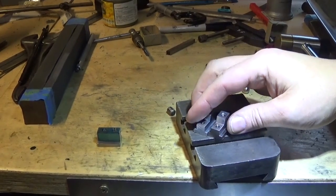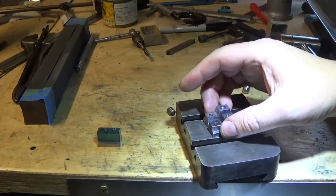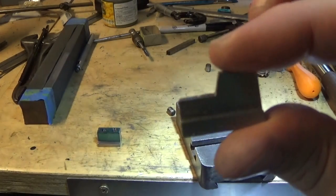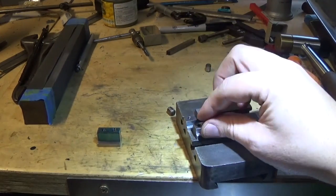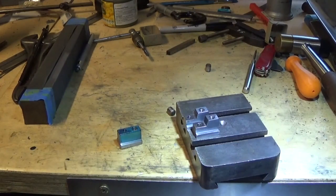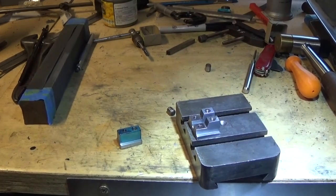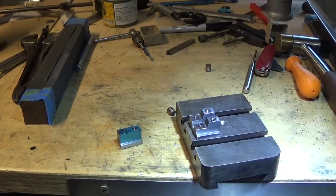But there are a few questions that have been asked about this, and a few questions that need to be answered. So this is probably the hardest setup of the lot — to cut this taper or wedge shape piece out of here. If we have a look, that's sort of what we've got. I've done two of them and I've got another one marked out, and another one in the machine just set up. I've tilted the head of the shaper over at 15 degrees and set that up nicely so they're all going to be the same angle.